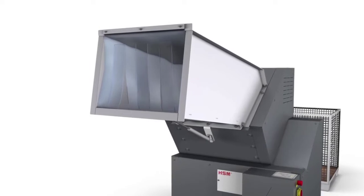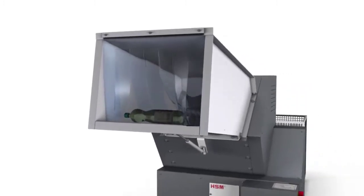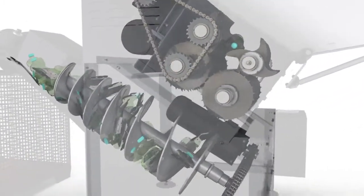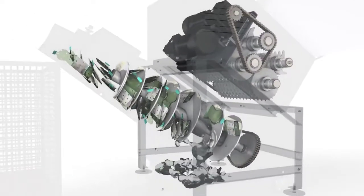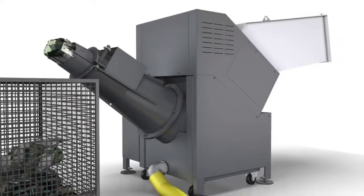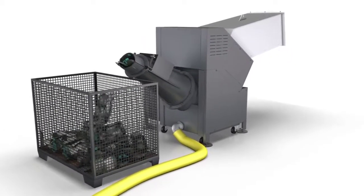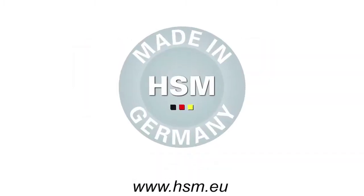That splash screen. Yeah. So you also need a plastic curtain because material can come out when we crush them, or fluid also. Yeah. And you see there's a 4-wheel or 4 axle unit to only catch the bottles, and the next one perforates the bottles. Yeah. And then in the screw we press out the bottles, and the fluid comes out on the bottom side, and empty bottles come out here in a container. But these bottles are not compacted very well. Yeah? Normally you can bring them to another press to make better bales, for example. Yeah? It's only a machine for emptying wrongly filled bottles.